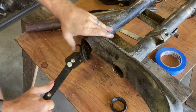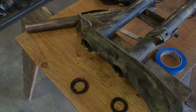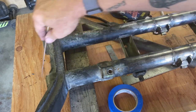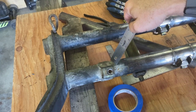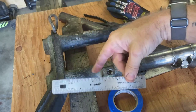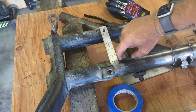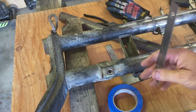This is probably overkill, but you got the job done. All right, I simplified my life. Rather than hunting for the bushing, the needle bearings are in each flush in there. I just measured the inserted part of the control arm — top and bottom one — and they're six and a quarter to about six and a half inches deep. This is a six inch ruler with an extra inch on that end, so that's seven plus, which means it ends there. If I take two inches out as close as possible to here and then sleeve it, I'm going to be golden. That is the plan.